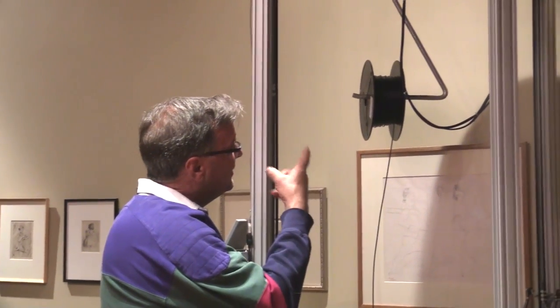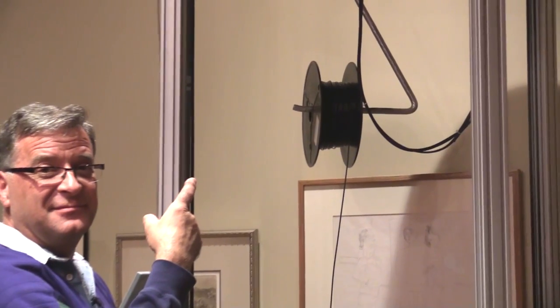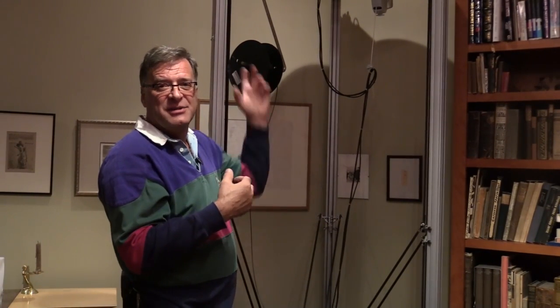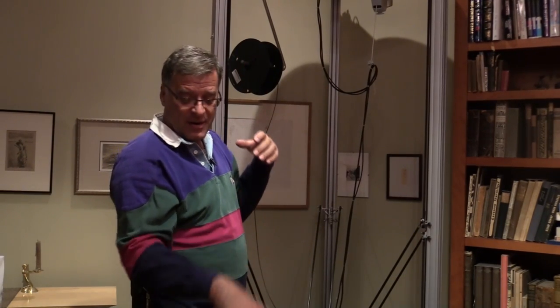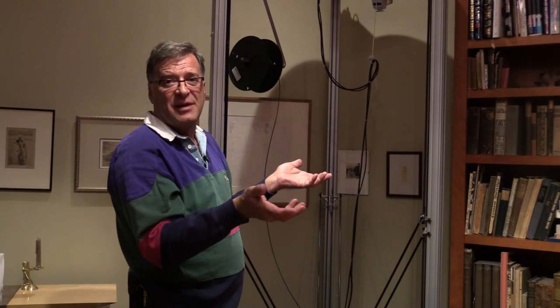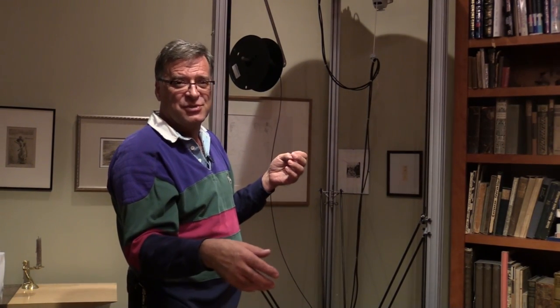What I'm doing now is trying to finish the pedestal that's going to go underneath it, but what I've run into is it's getting late at night. I'm about ready to go to bed, and that spool is not going to last the night. So all I want to do is pause the print, move the print head up and out of the way so that 500-degree Fahrenheit print head is not sitting right on top of my print. I'm going to take that almost-done spool off and put an almost-full spool on so I can sleep all night and not have to come out at 1, 2, 3 o'clock in the morning to change the spool.